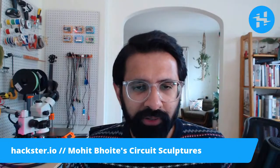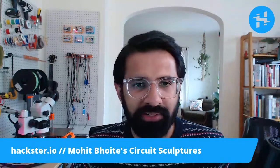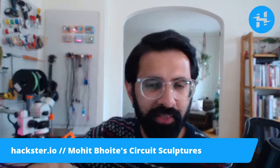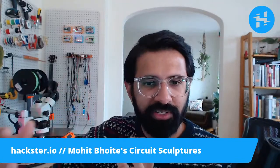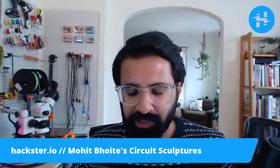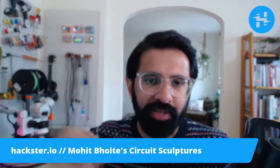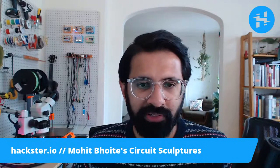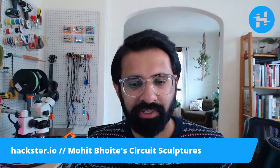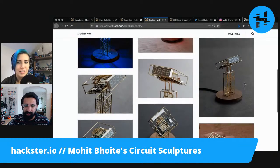Then there's ham radio builders, who also use something called Manhattan style, where you use a PCB as a ground plane and then you lay electronics, but in a dead bug form. And so that's actually extremely suitable for that hobby because you have a reference ground plane and you have electronics on top of it, and you can build complete radios with that technique. I've seen some of that. It's incredible.